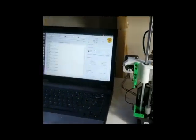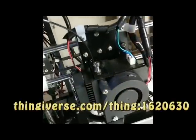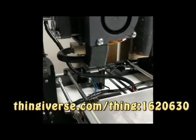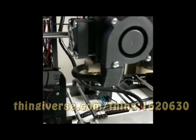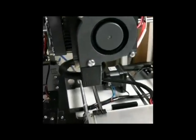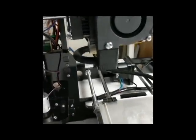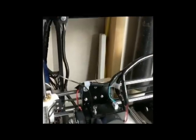Normally, down here, your fan nozzle would look like this right there. Don't use that — just print this ring fan nozzle. It's on Thingiverse. It's really amazing and it'll make your parts cool more evenly. To keep it in place, I took a 1/8 inch drill bit and drilled through the fan right here, then put a little wood screw in there. That's the first mod I did to this thing.